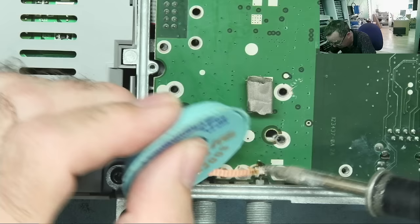ESR. Just zero it first. Zeroed. I think you said error, but I'm sure it was zeroed. Oh, error less than 1 ohm, that's the tolerance, if you like, okay. The resolution of the meter, let's see. Yeah, 7.76, that's really bad. This one. Yeah, very similar. Not quite as bad, but bad enough.